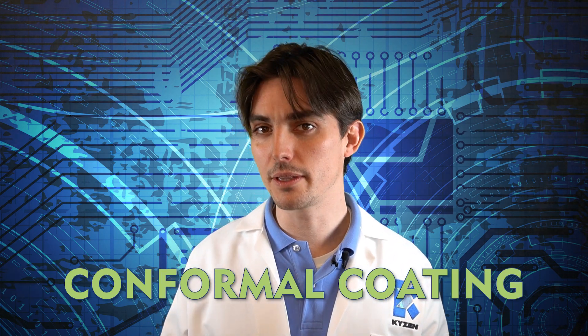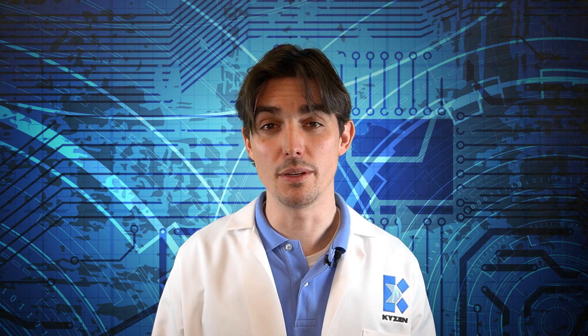The next thing you can do is to use a conformal coating. A conformal coating won't completely block the dendrites, but it will act as a very good moisture barrier and diffusion barrier to these metal ions, preventing them from plating as fast. In a nutshell, a dendrite is just a small metallic growth that grows between two traces on a PWB that are biased.